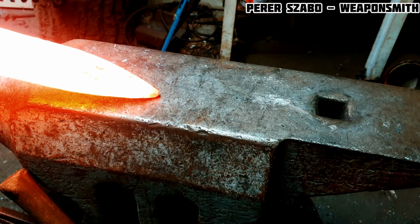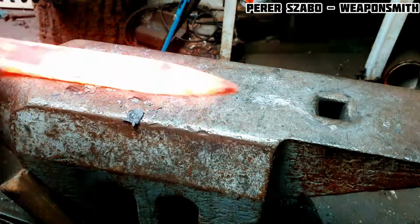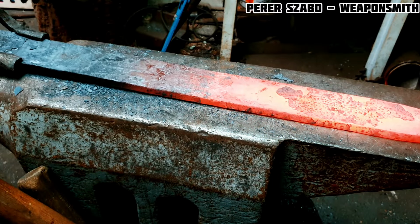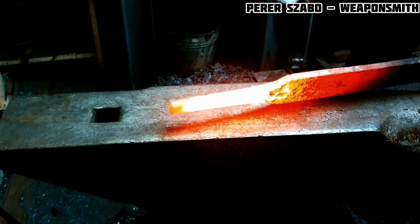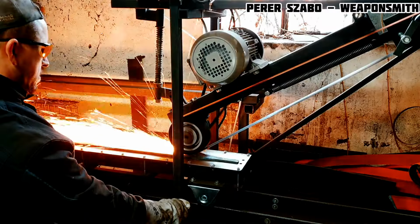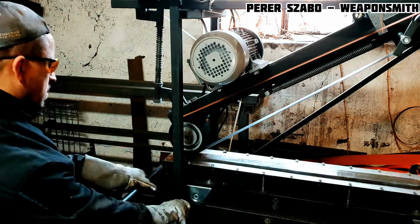The third method I use is induction heating. It is a very fast, accurate and effective method. There is no such big waste of energy here, you can turn the device on and off at any time. The problem and disadvantage is the high price of the device, and the fact that for each shape and size of steel you need a different coil that ensures the transfer of energy to the material. I use each of these methods, each one for a different activity, and therefore production is of higher quality, faster and more efficient.